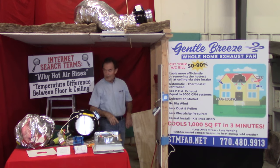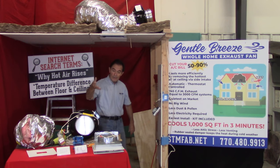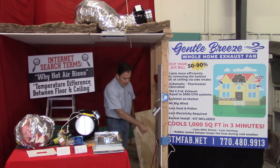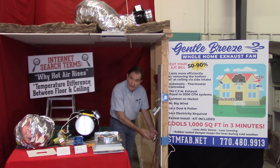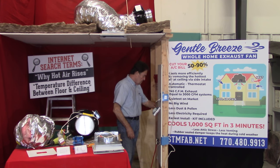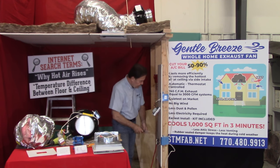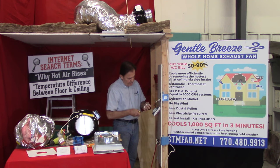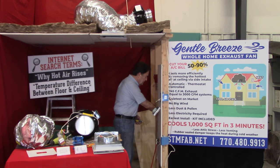Once you're up there, you've taken the motor, the duct, the drill, and a battery-powered light — most attics won't have a light. We know where our power source is. We're going to pull the cover using a straight blade screwdriver, a small one. Pull the front cover — when you get back to this outlet, clean out the screw heads before you try to put a Phillips head in there.